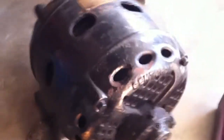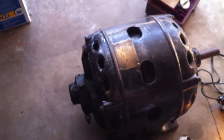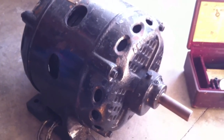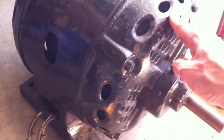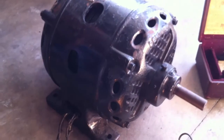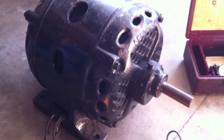Anyway, there she is. I'll try to get some oil down on that mechanism and see if I can make it start behaving better, because otherwise it seems to work really well — seems to be a good motor. It's a little vibrate-y. They all seem to be a little bit off-balanced. It would help if it was sitting flat — it's kind of teetering on two feet. I should put a wooden shim under one foot; that'll make it run a lot smoother, I'll bet.